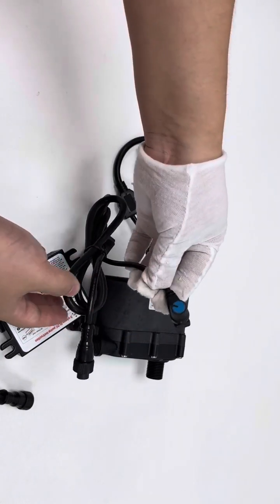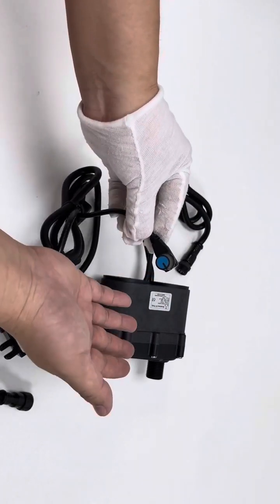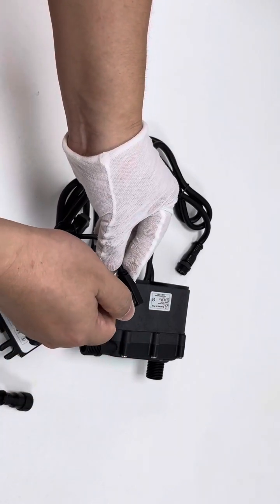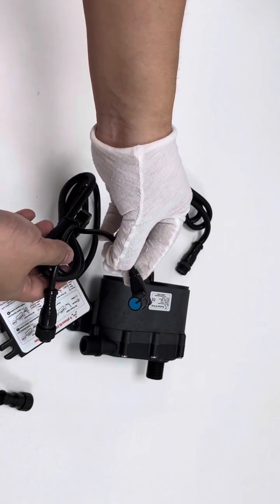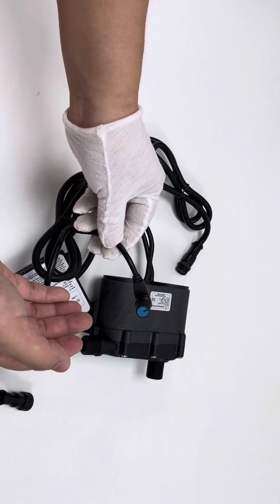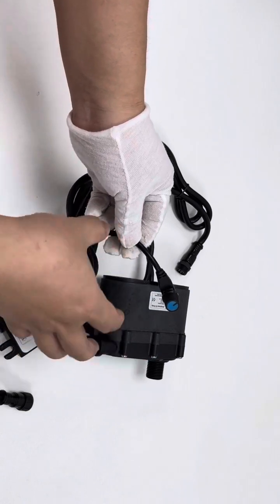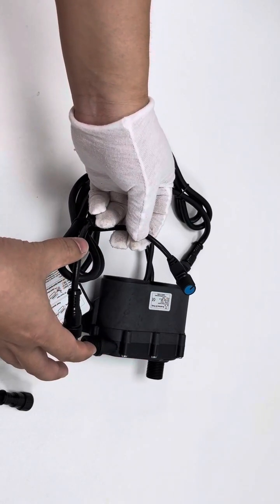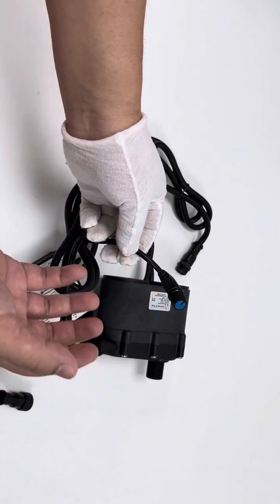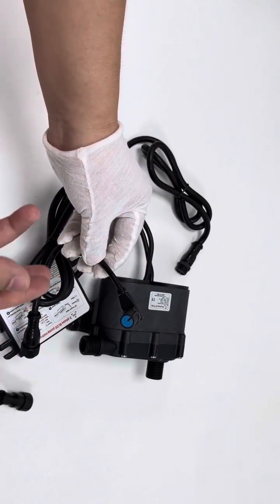In the meantime, as we see, this is the potentiometer knob, where users can flexibly adjust the power, the flow, the lift of this pump when it works by rotating the potentiometer knob. For some special demand, if our users need PWM or a 0 to 5 analog signal to control the flow of the pump, it can also be customized based on MOQ and a certain lead time. Of course, by default, it is always the potentiometer knob that is offered to our customers.